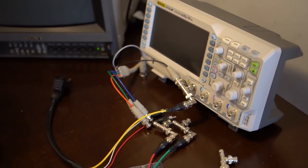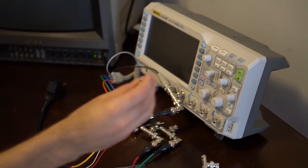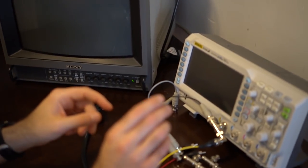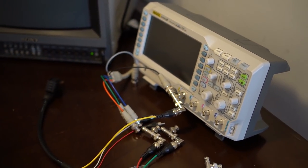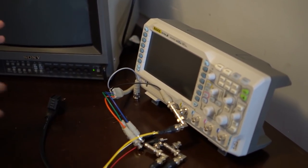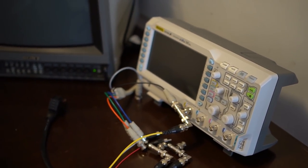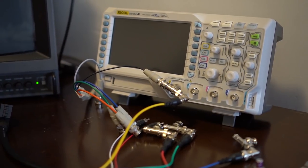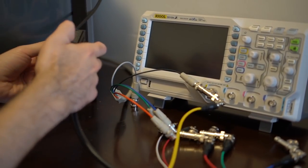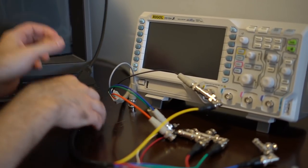No — I think it would be a little more complicated. You can run it through the input and output, but then you'd need to terminate with terminators on there. You could do that, but I typically like to terminate at the monitor. So if I'm looking at stuff and want to view it on the monitor, this is how I typically do it. So for now just grab the SCART cable on the other side of the monitor and plug that into the female input. Okay, so we get sync.